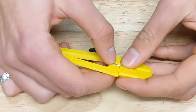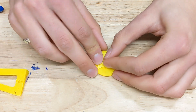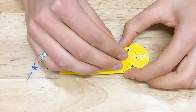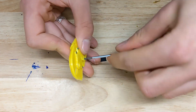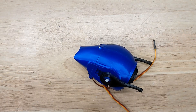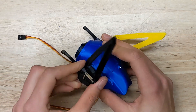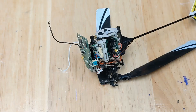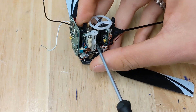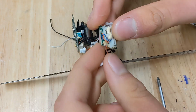I made a little brass pin to serve as a pivot point for the robot's ears. And I took a toy industry approach to durability by designing in a good deal of mechanical slop, to help prevent the thing from breaking itself if it encounters resistance at any point in time. There are a few components for this head that are salvaged from old RC aircraft and carts — these sub-micro-linear servos from a four-axis model helicopter are a great example.